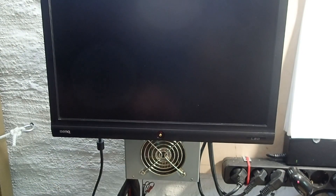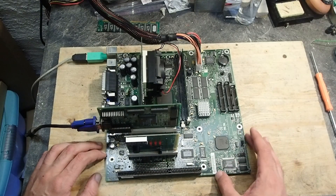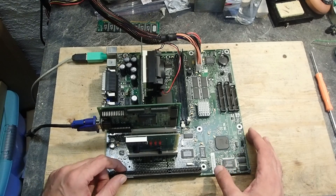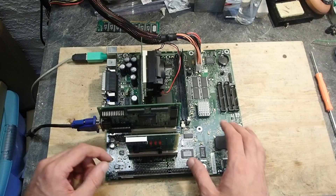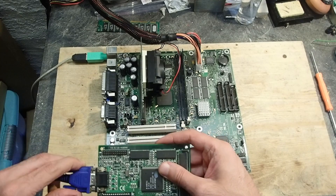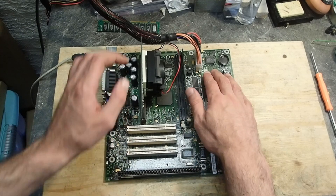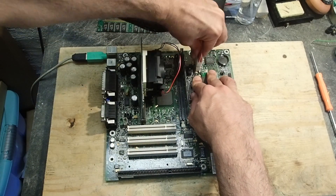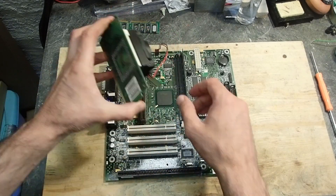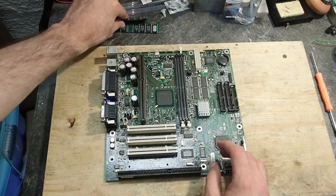This is a really sad story. The board is quite interesting, but I have no replacement for the graphics chip and I'm not able to resolder BGA chips with my equipment. The board has obviously other issues as well. I'll put it in my stash of spare parts — either as a donor for another board, or perhaps one day I'll find a Riva 128 ZX chip and try to replace it.